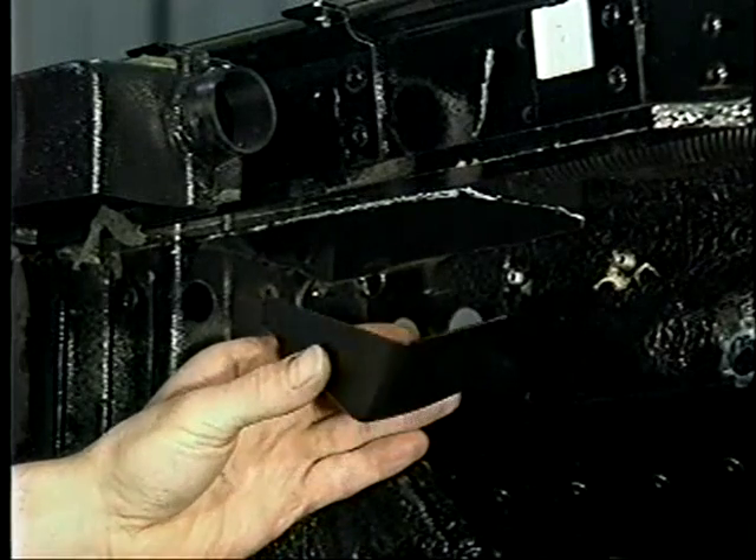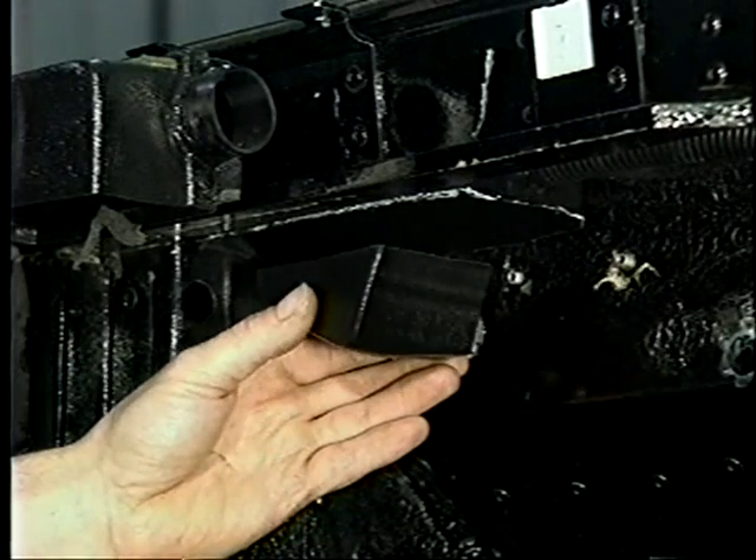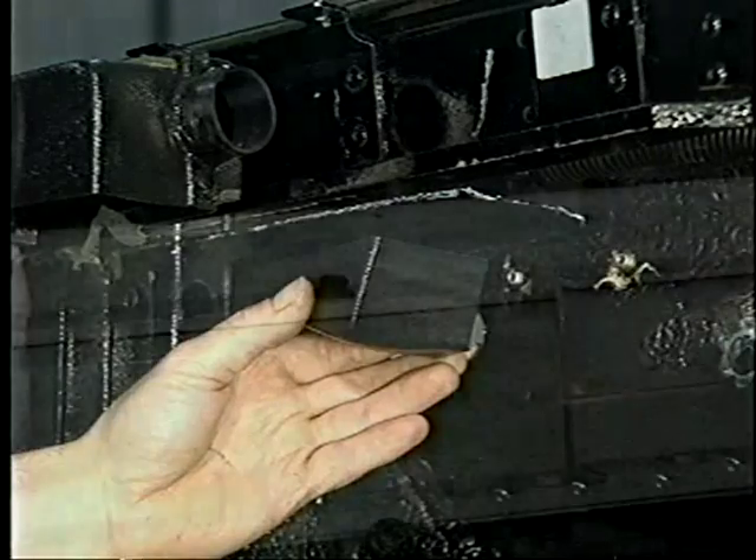Some vehicles may require installation of a plastic cover inside the duct to eliminate air loss. Next, the right-side outer windshield retainer is removed and a nut insert is drilled out. This will allow for proper duct alignment of the new unit; a new insert will be installed later.